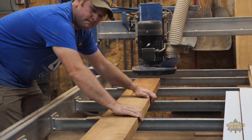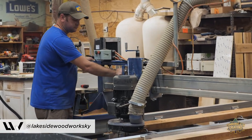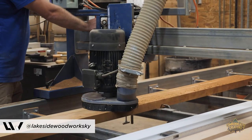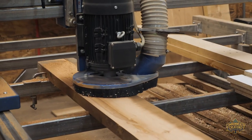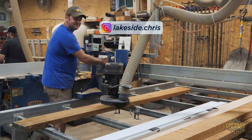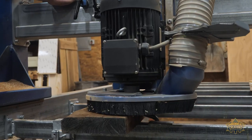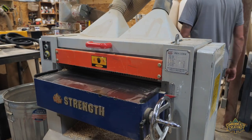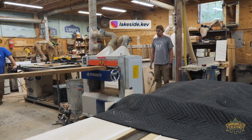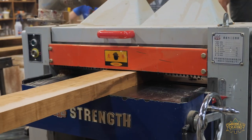To begin the desk build, I headed over to my friend's workshop at Lakeside Woodworks in Georgetown, Kentucky. Due to the size of the desktop, I asked for their help in making the top because it's too big to be made in my workshop. To start the process, Chris used the Slabmaster to join one side of each 8-quarter cherry board. Using a planer, we then proceeded to surface plane the opposite side to make sure each piece is co-planar.